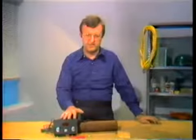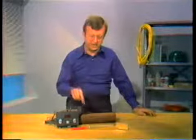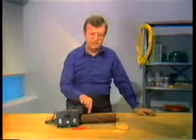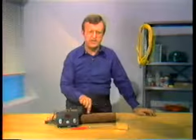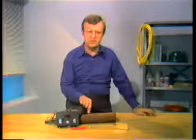It can sometimes be detected by direct observation, but for a more precise measurement of tube thinning, an ultrasonic instrument must be used. Now, with this, you measure tube thickness on a worst-case basis. For example, if one section of the tube exhibits severe ash erosion, you would take measurements in that area.